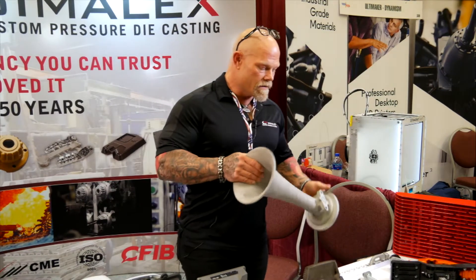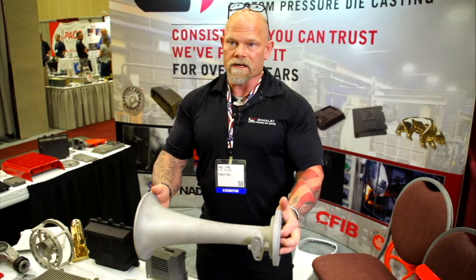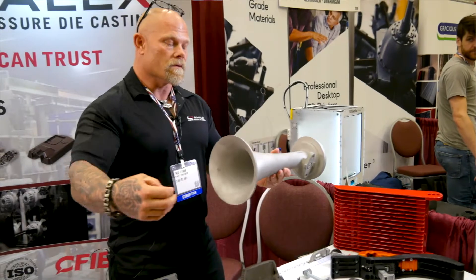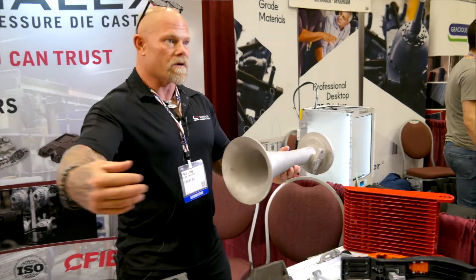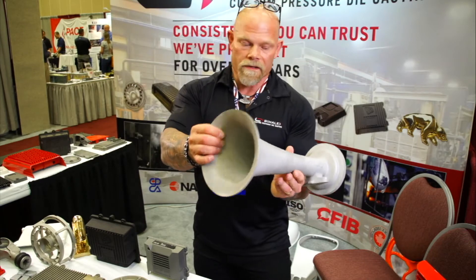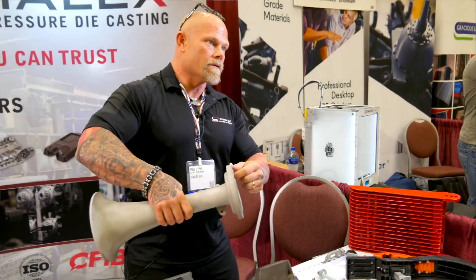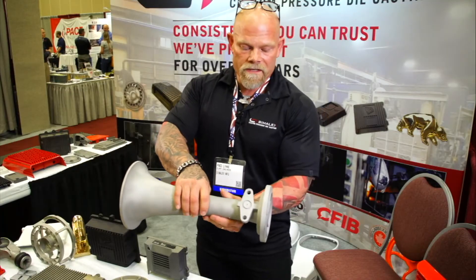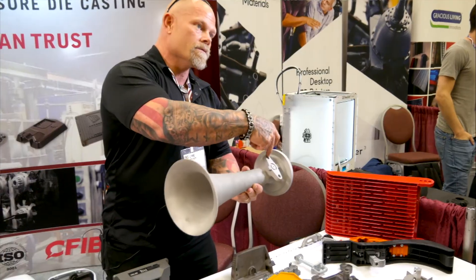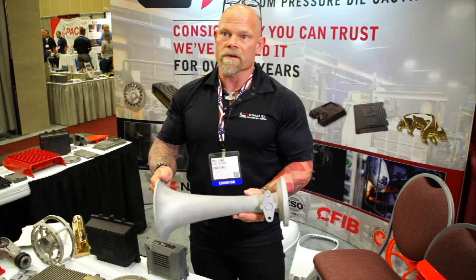This is an interesting part in that you can see the mold is split. As the part is cast, it needs to be ejected out of the die. In this particular case, we have a hydraulic core pull, which creates this long shape throughout the inside. We also have a mechanical slide, which creates these features on the end. We also have an additional mechanical slide, which pulls this way to create these features and the holes here, all in one shot — simple deburring operation, machining, and it's ready to go.